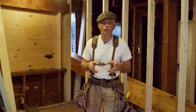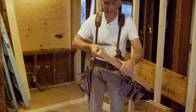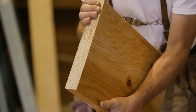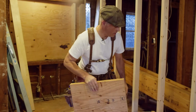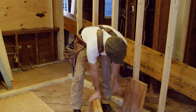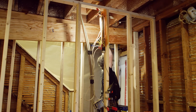I also think it's appropriate to take a moment to talk about what LVL beams are. This is very simple — basically a laminated veneer lumber. LVL is basically that, and from the end grain it looks like plywood, but this is a structural member. The beauty of these, and the reason why we like to use them in our remodels if we can, is that you can stack them together — you can laminate them to whatever size you want to make a much larger structural member.